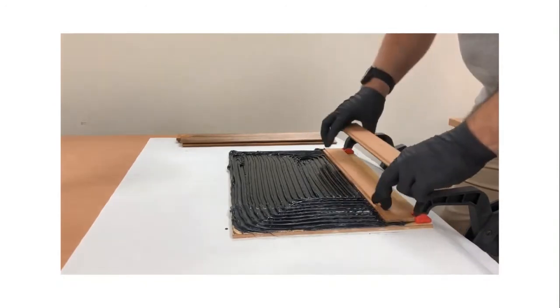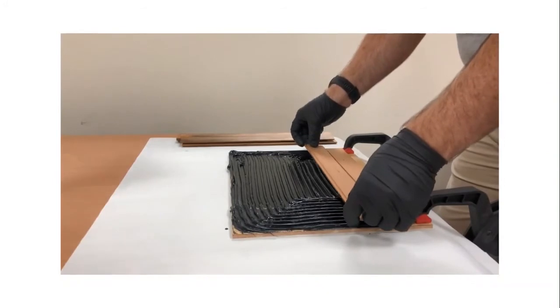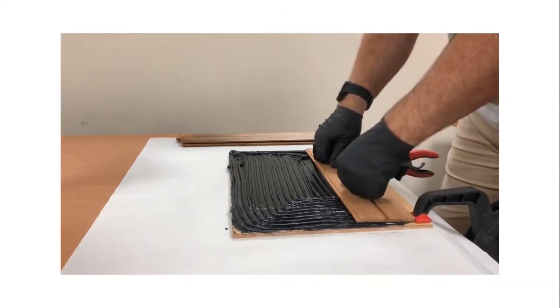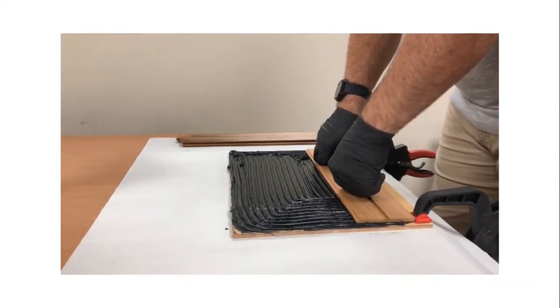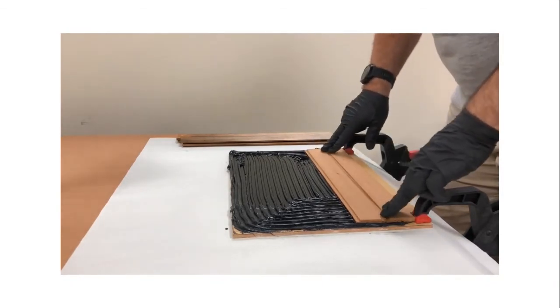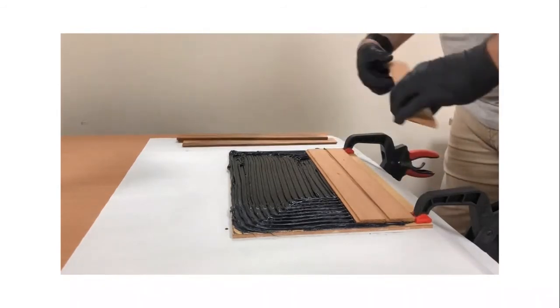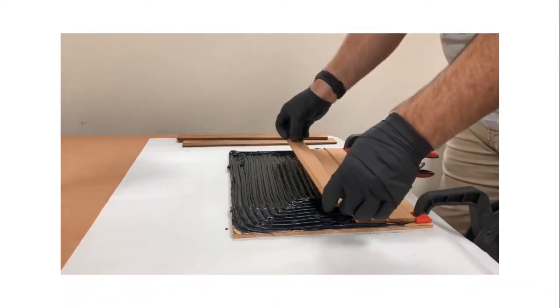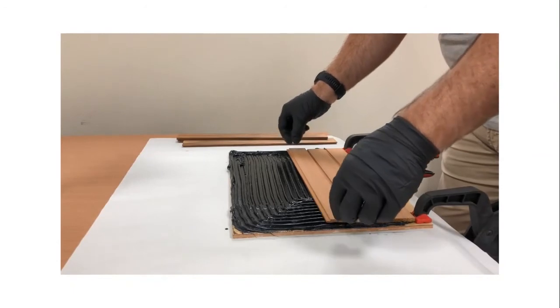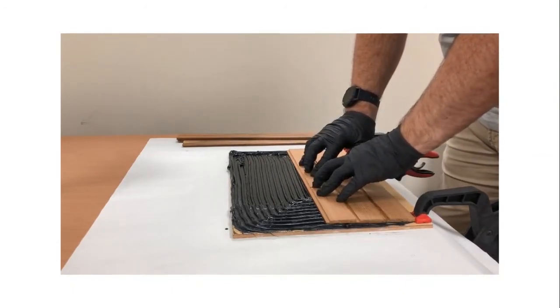Yeah, we did some work a little while back, going back a few years, and we found that using the flexible adhesives gave you a better sound characteristic inside the boat as well. Though we found the epoxy ones were probably better for doing large panels, when you're doing pre-made panels, which they put onto most boats now. But traditionally laid decks tend to prefer these flexible ones. Yeah, no mix ratio to get wrong either.